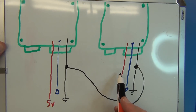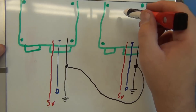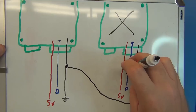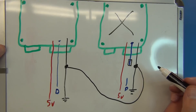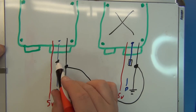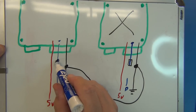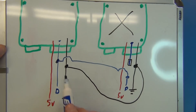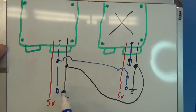The data from only one controller is what we want — we're going to cut this wire on the other controller and terminate it with some shrink wrap so no data comes out. Then over here we'll simply tap into the control line with a data wire and come over and tap into the second strand's data input as well. The data will come out of one control box and enumerate both strands down those data lines.